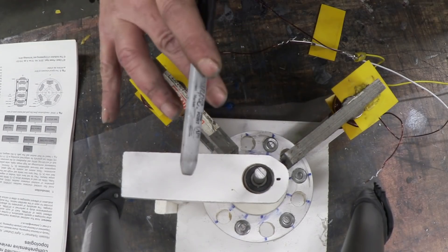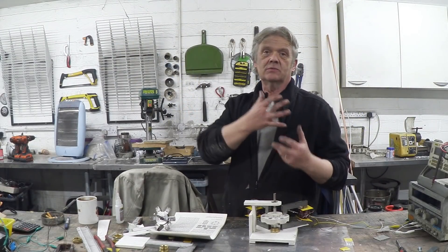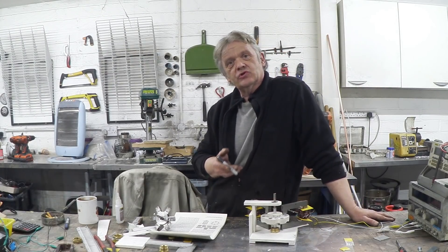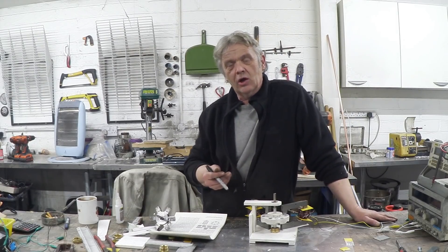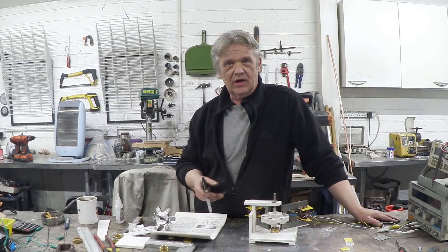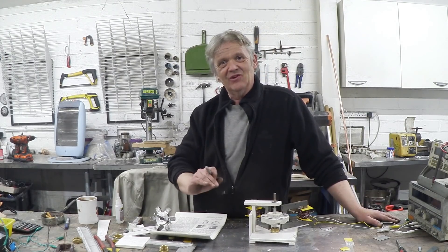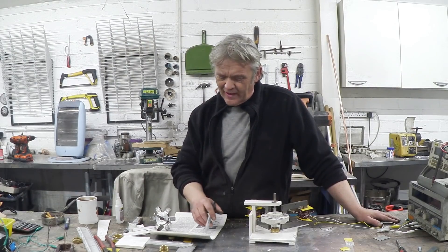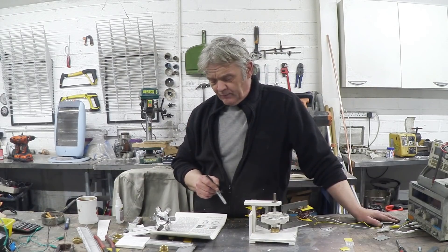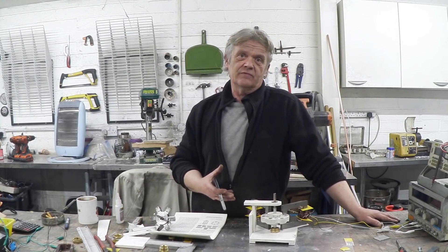That is what I was talking about and the basis of the motor. So if these two C's were only electromagnets — that is, a C shape of metal laminates with only a coil around them — it would in fact be something called an axial flux reluctance motor. If you pop that into Google Scholar, you'll find a ton of research on these motors with their various benefits and detriments. I've got a paper here called 'Axial Flux Switch Reluctance Machines: A Comprehensive Review of Design and Topologies' — I'll pop that title and DOI in the description. It's an open access paper.